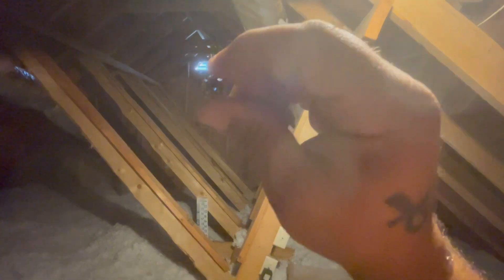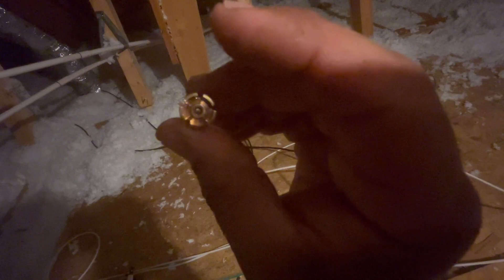You want to hold it up to the light and check - you can see straight through it and you'll be able to see if there's any type of blockage. A lot of times there'll be a piece almost completely covering the outside of the orifice right here. But this one wasn't awful. The next step is to look and make sure this is the correct size piston, because I don't believe it's going to be right.